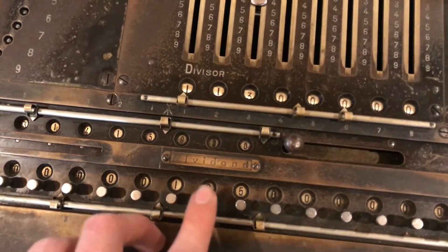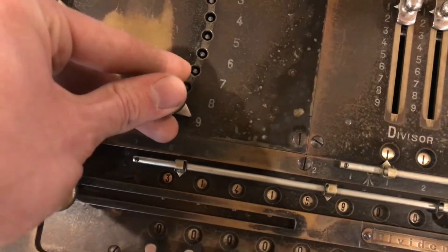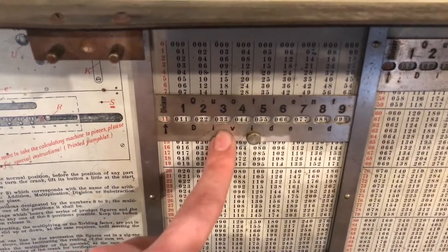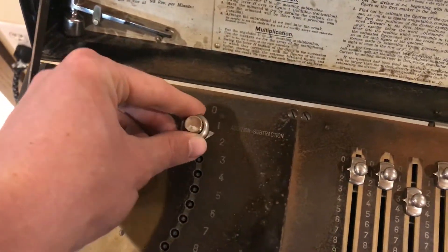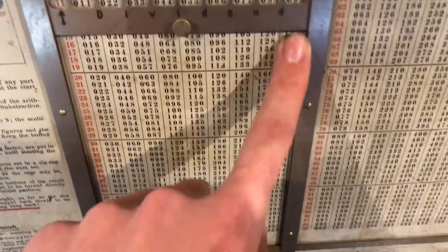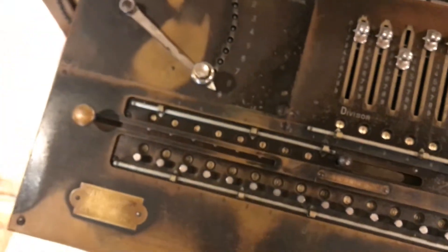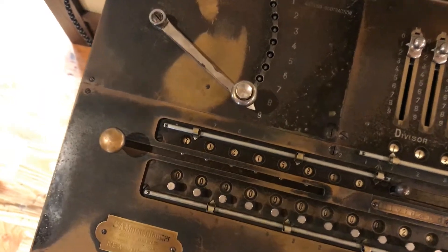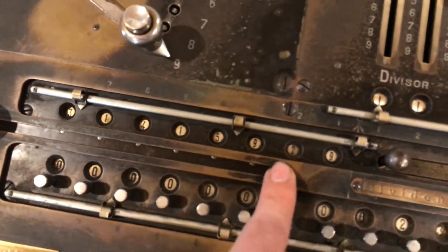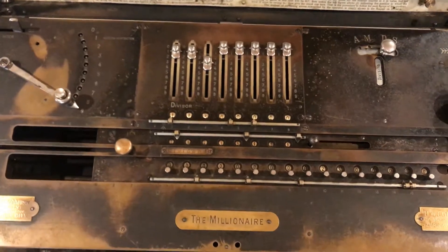Now we have 1, 0, 5 — back up to the table, that's greater than nine, so enter nine. Now it's 0, 3, 3 — if it is exactly that number you still go with the lowest one, so enter two. Now it's 1, 0, 4 — which is above 0, 99 — so enter nine. This time it dings because the carriage is in its leftmost position. Now we can look at our quotient, and the counter with the decimal point is 3.1415929. So we successfully estimated pi with a 110-year-old electric mechanical calculator.